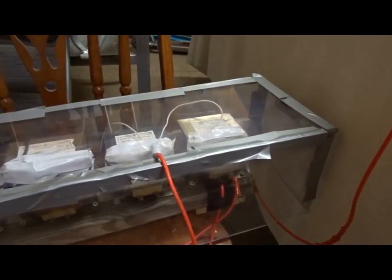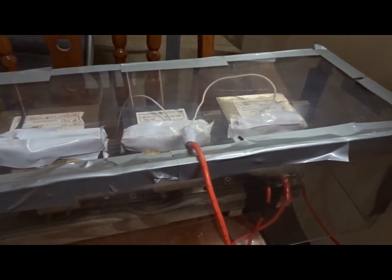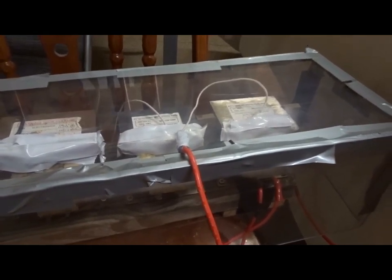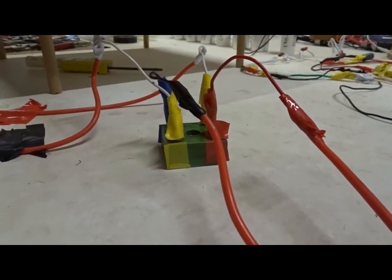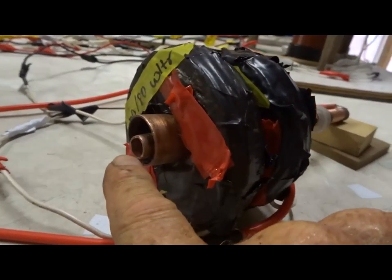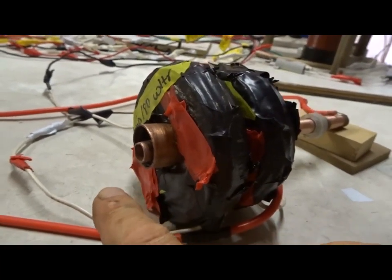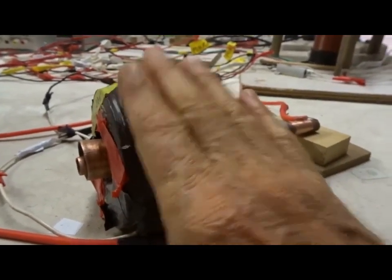You can make power of AC or DC quite easily at 2,000, 4,000, or 6,000 volts from these microwave oven transformers — AC power directly, or DC power if we include a full wave rectifier. And once we have an arc of ionized argon gas, the really interesting effects happen when we turn on DC or AC power to these two wire coil electromagnets.